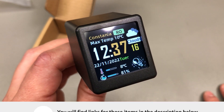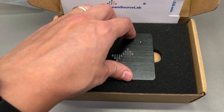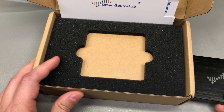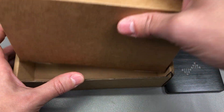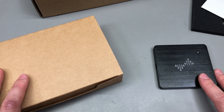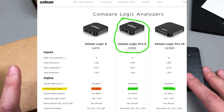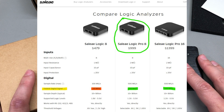My last item today is probably the most interesting — the DSLogic Plus logic analyzer. I've been using one of those AliExpress clones for years that worked with the Saleae software, but it's only good up to 24MHz. Recently when I had to probe a 40MHz SPI bus I couldn't do it. I looked around and thought I'd spend a little more to get the proper Saleae logic analyzer. I was expecting something around $500, which I was ready to spend, but the baseline Saleae only goes up to 25MHz and I'd need the Pro version starting at $1,000 — clearly outside my budget.